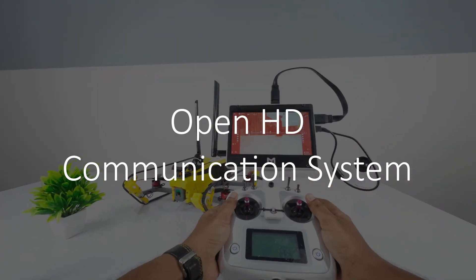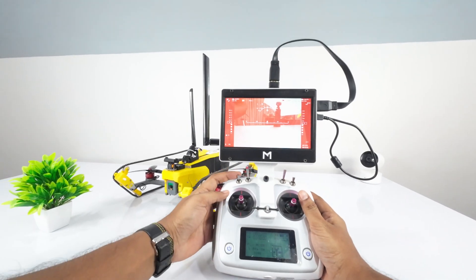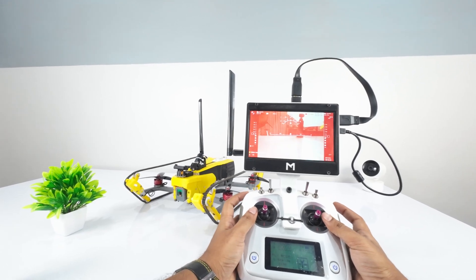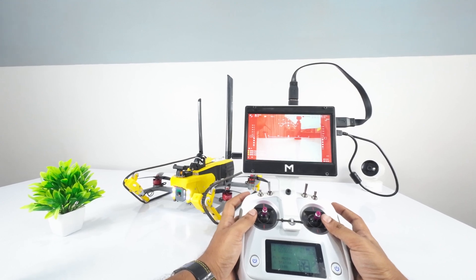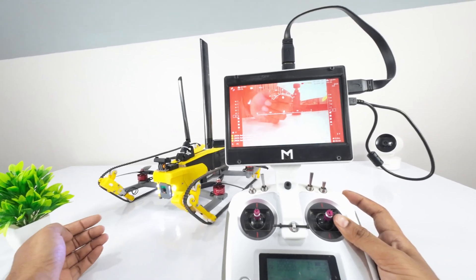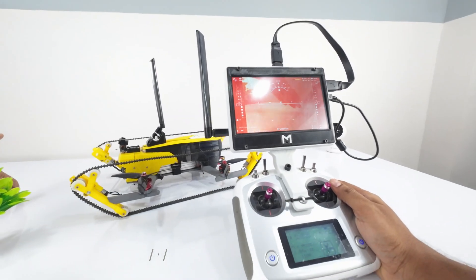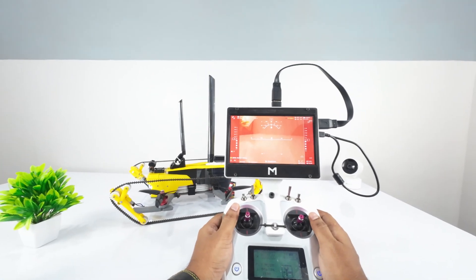This is the console I am going to use. You can see the OpenHD screen with all the parameters required to fly a drone. The left switch is to change the mode from drone to tank. The right potentiometer is to tilt the camera, and the left one is to turn on the lights. There is no lag in the video transmission, possibly because both antennas are close to each other. This complete console is 3D printed for a 7-inch Waveshare screen, and you can find the files from the link in the description. For those who don't know about OpenHD, it's an open source communication system which helps transfer real-time footage using digital signals and also works as two-way telemetry.